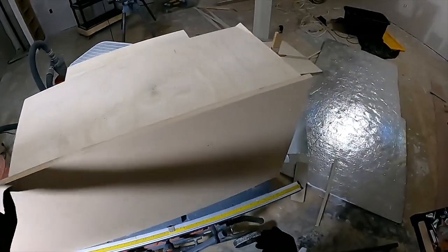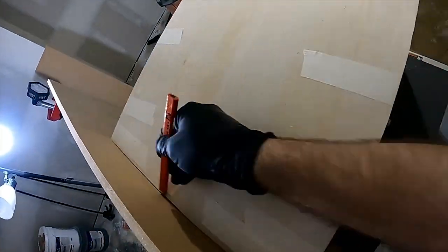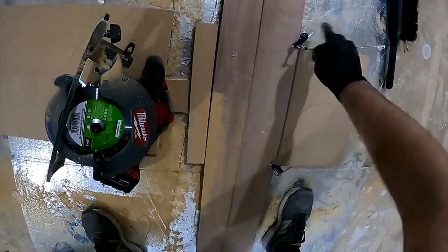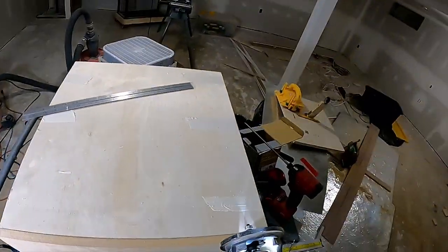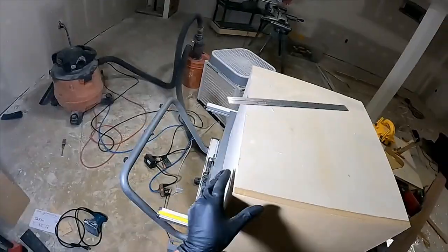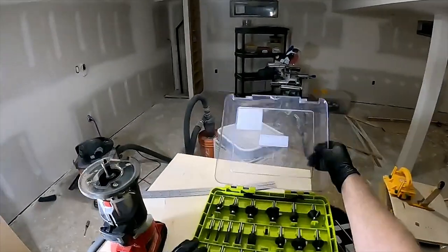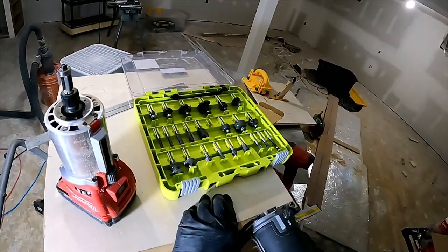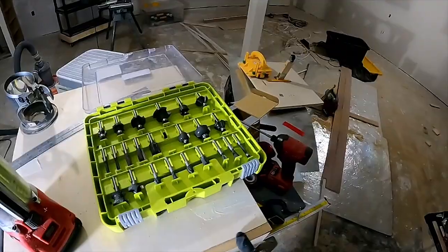Let's see what we can do about getting a door for this thing - I wonder if I have a piece of MDF big enough. It'll be close - hey we can do it. Drawer front - I made a box tracing the box got me pretty close, but to get as precise as I cared about I came back and ran the router with a flush trim bit over the edges. There's a little bit of an oopsie here but it mostly did its job. One thing I might want to do before freehand stuff again is get the bigger plate on, because when I'm right on the edge it's really easy to tip it a little bit, and that's what happened here.